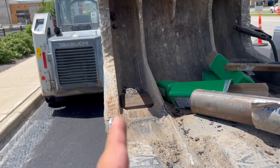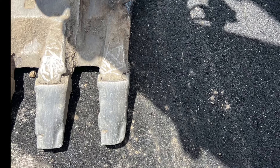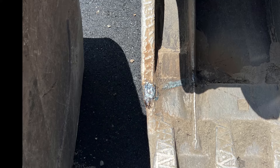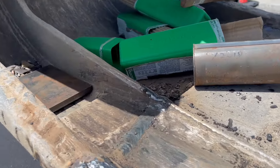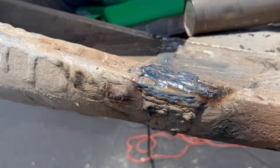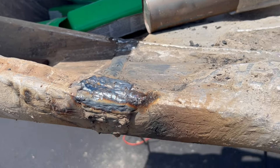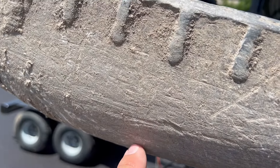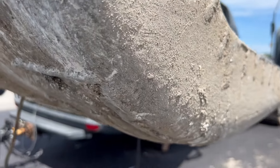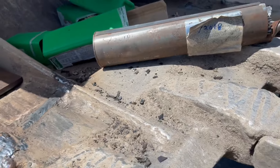My recommendation is to replace that outer plate. When you look at it, right there you can see how the tooth is set in to the left and the plate on the right is worn off. On the other side, the plate just stops right where the crack starts and the end on the front is worn off. Replace that outer plate with a fresh one and you get another hopefully 10 years out of this bucket, because that backbone needs to come back all the way as one solid piece. With the wear it's rounded off — there is material lost over the years, and the remaining material is stress cracked. The hard surfacing here is great, but there should be hard surfacing on the outer edge too because that's a wear point. It makes the spine really thin, and then you pry a little bit and it pops — you're going to break it.